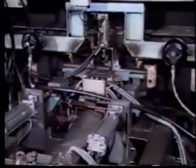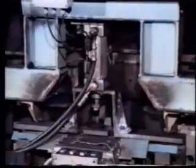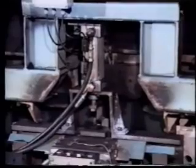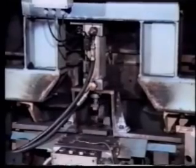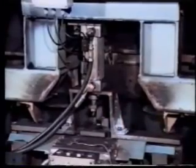The equipment used in the pilot plant for the development of this process is shown here in operation. After the mold shut-off device is actuated, the pump is withdrawn, allowing the mold string to advance. The pump is then aligned with the mold and moves in to seal against the metal entry port on the mold. Pump power is increased in an accurately controlled manner to properly fill the mold. When the mold is full, the shut-off device locks the metal in the mold while the pump power is reduced to bias. The pump is then withdrawn from the mold and the next mold moves into position.